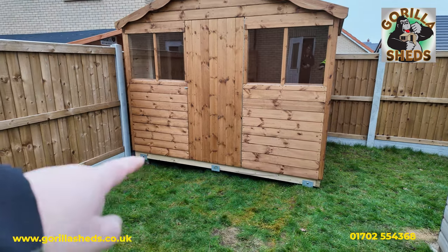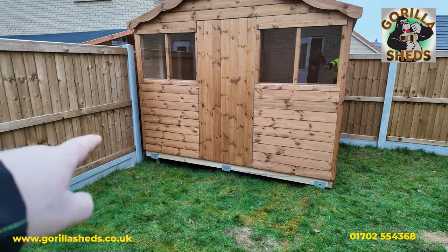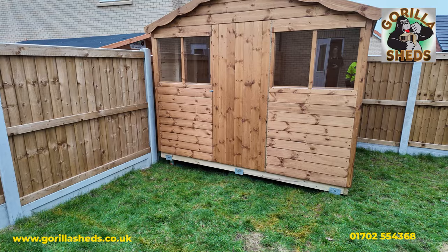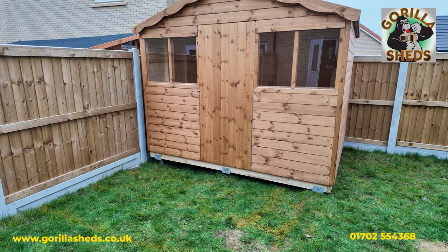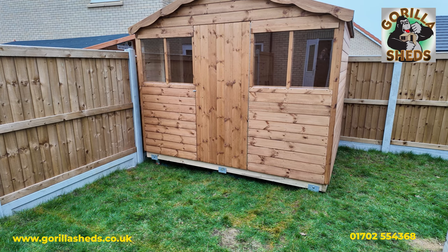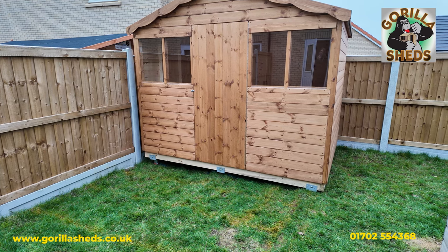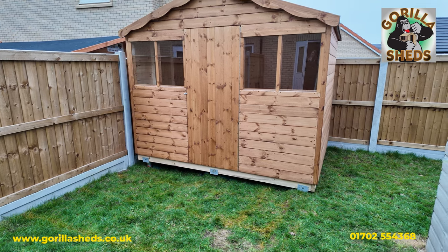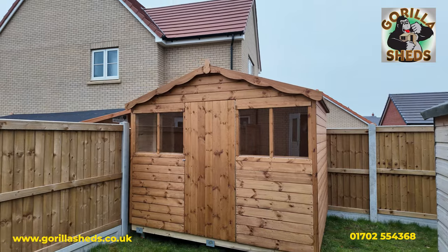You can see underneath there that there's no base as such. We've got a ground screw there, ground screw there, ground screw there. There's 9 ground screws under there. Each of those ground screws is capable of taking at least 400 kilo. In the soil we've got over here, I'd be really, really surprised if those ground screws couldn't take about 1.5 tons each. They're massively, massively strong.